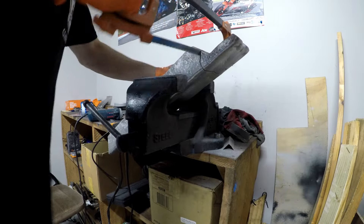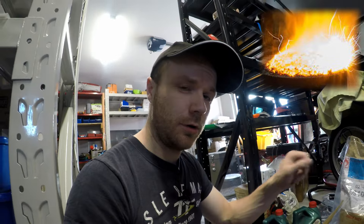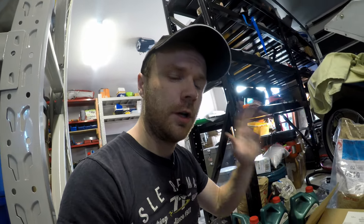Quickly cutting up some metal to melt down. A few things we're going to have a go at with this casting to try and improve the quality. We've got this stuff here which is hot topping — that stuff bursts into flames when you put it on top of the molten metal after you've cast it. It keeps the top hot so that's the last part to solidify, so the feeders feed the mould correctly.